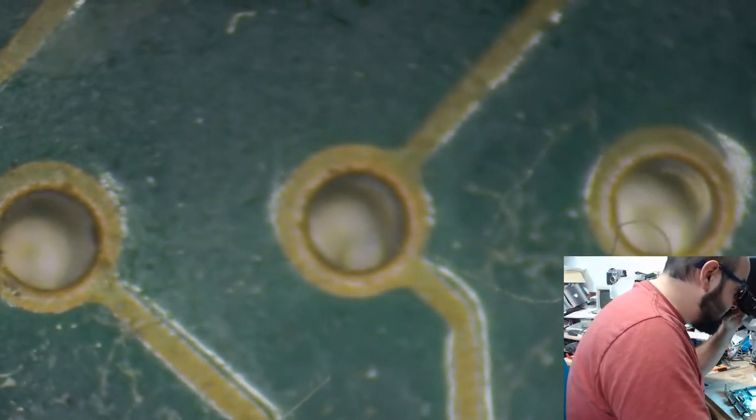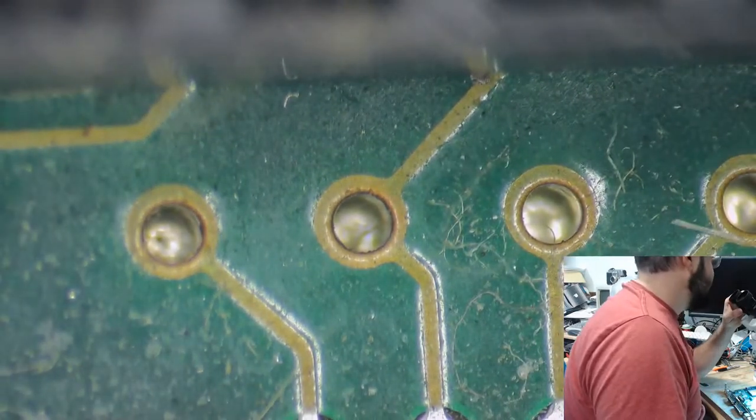All right, keep my glasses on for this. Now, hopefully, yeah, that's not too bad. So, I'm going to take the ROM sim out, which the plastic is already cracked on, just a little bit. Yep, and it's still partially attached, so I might be able to glue that. But here's the ROM sim. I am putting a label on this, because I will put it aside and think it's just memory for a Quadra. All right, put some tape on there, and then write on the tape, SE30 ROM. There we go. Now I know what it is. Yeah, I think she's planning to do something like that.